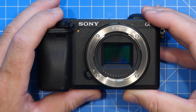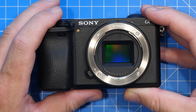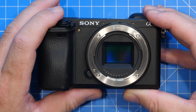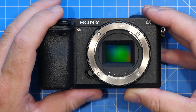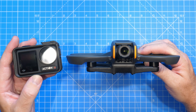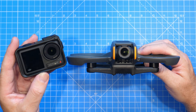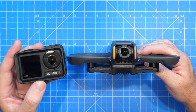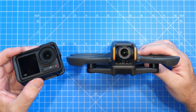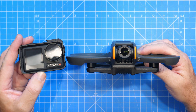These sensors are made up of lots of little pixels designed to capture the light being projected on them from the lens. Most sensors are designed around a standard configuration known as a Bayer configuration, and this setup has become the standard in video and photography today. Depending on the camera type and its designed use case, they will usually have a field of view equivalent of between 10 and 24 millimeters. Action cameras tend to have a wider field of view down to the 10-12 millimeter range, FPV drones something similar, whereas camera drones like your mini series may be in the 20 to 24 millimeter range.